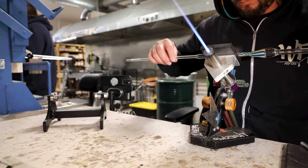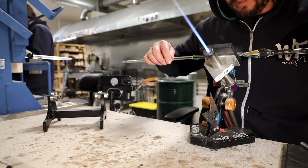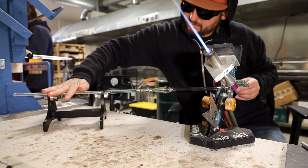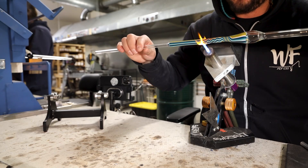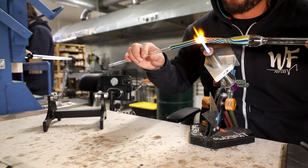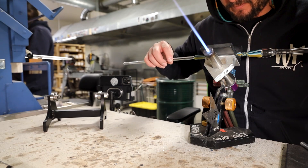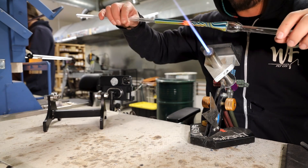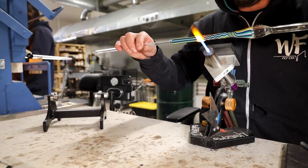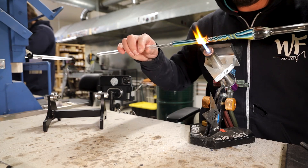I'm coming about 15 degrees back, rotating the handles in perfect sequence as I add that little kick into the tubing. If you can repeat the amount of spins, the angle, each kick, you'll have the same size kicks progressing down your tubing.